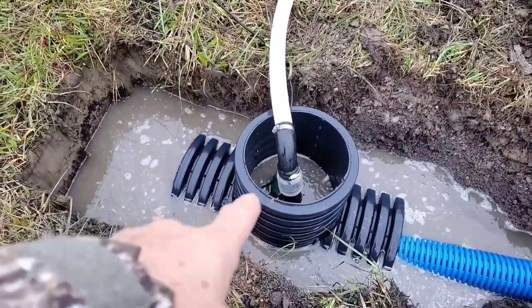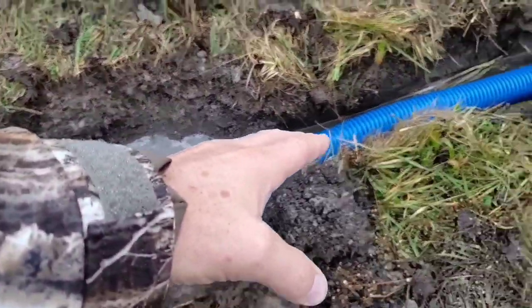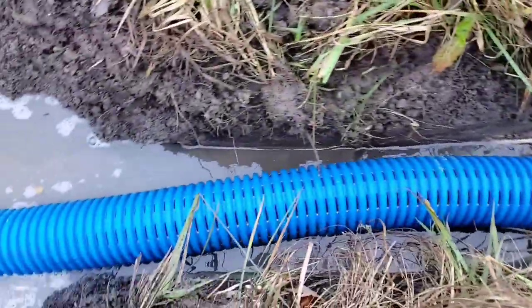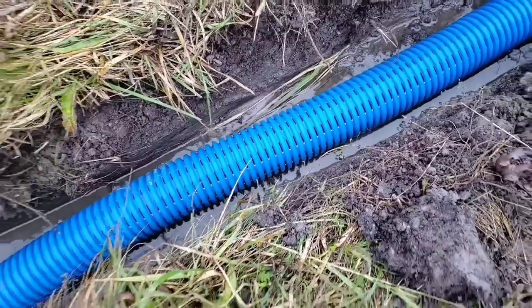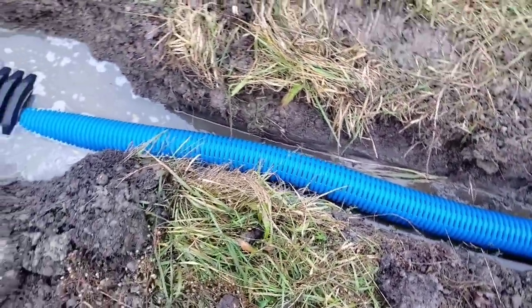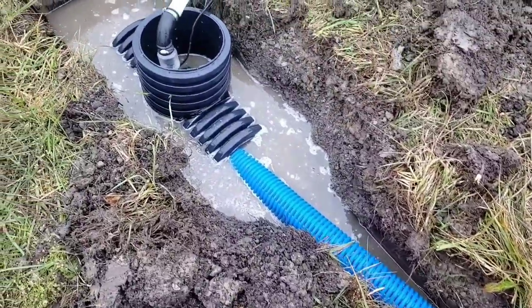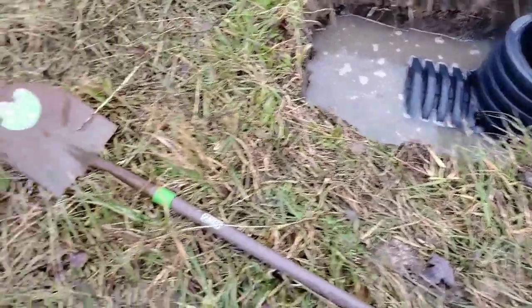We got this pump plugged in. So here's what's going on. Water is backfeeding up into the French drain system. Do you see it? The water is in the French drain trench. What does that do? That's going to turn your entire yard drain into a reservoir, and the trees and shrubs are going to smell that. Their roots are going to fill it. What could have prevented this?